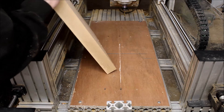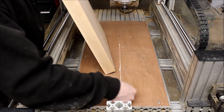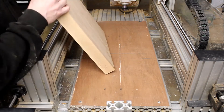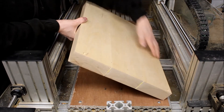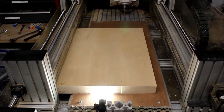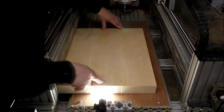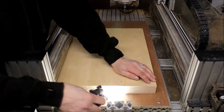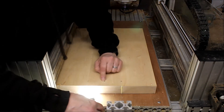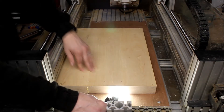Okay, we've got our locating holes, they're all drilled through, got our pins in here, or at least four of them. And all we need to do now is locate this. A handy tip — try to get this located in here, there's a bit of a pain, but if you've got a really powerful torch like this tablight here, you can shine it underneath and actually see where the pins are, which helps you locate them easier.